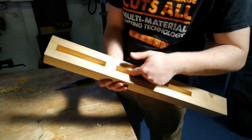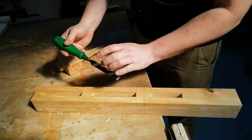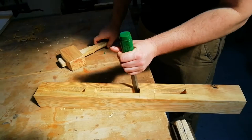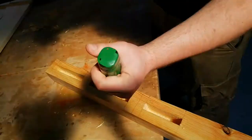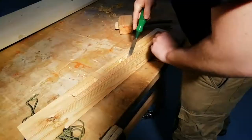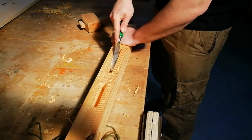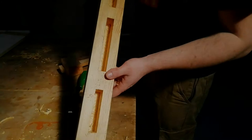We need to remove the leftover debris in the mortise from the mortise machine. Grab a chisel — I've got one that's a little tiny bit smaller than our gap — and knock it all the way round. Try and keep your hands behind the blade. And we've got a smooth bottom now for our mortise.